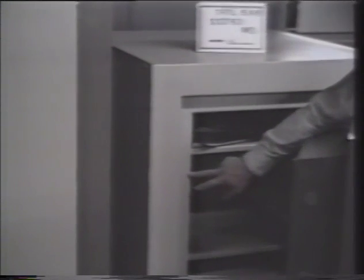Look at this door, this massive TRTL 15x6 door. We see the 1.5-inch to 2-inch bolts. We see the thickness of doors all around. It translates to the same as the wall. Because this is a by 6, all 6 sides are protected with the same type of protection as the door.